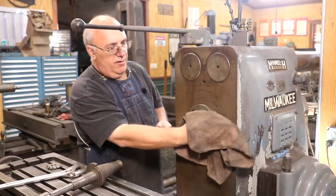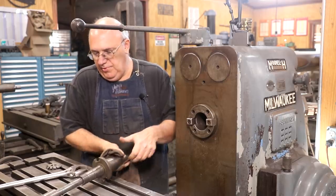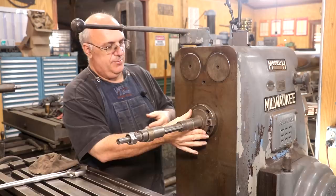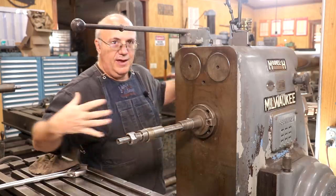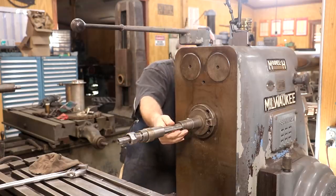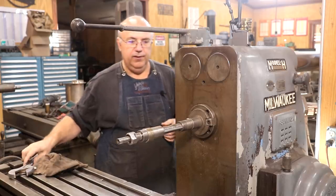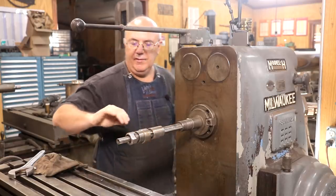First step is to get our arbor set up. I've got a horizontal arbor here — this is a one-inch arbor, so the diameter of the shaft is one inch. This is a 50-taper socket. There is a draw bar, which is basically just a screw that goes through this; you tighten that up and it pulls it in nice and tight. I'll screw that in from the back and get a wrench to tighten it up. There we go — my arbor is installed now, nice and stable, and we need to get our cutter on there.